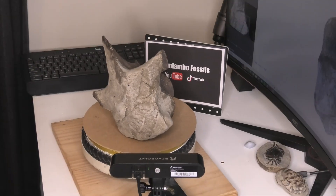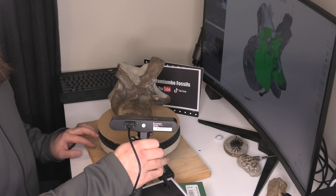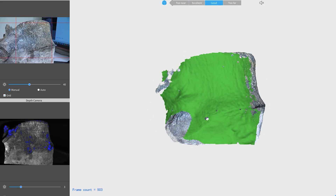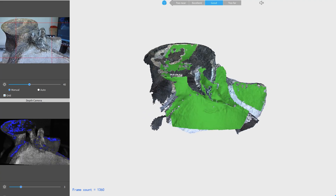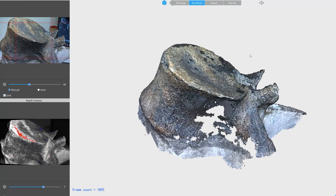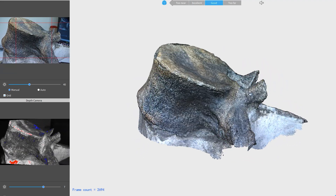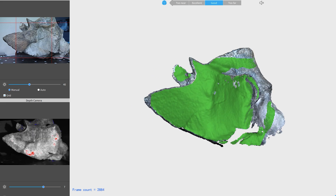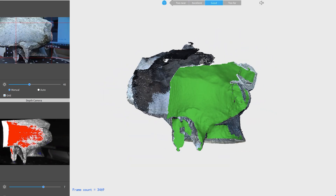What's nice with the 3D scanner is you can keep it on the tripod, but you can also pick it up and try to get into the areas that are more difficult to reach just by lifting it. You can see on the screen that everything in green is being scanned. In the bottom left you can adjust the power of the laser or infrared scanning it — if you're seeing a lot of blue, turn it up; if you're seeing red, turn it down. What I found worked well is to overexpose it, rotate it around, then pause it and underexpose it. That allows you to get a really good mix of getting into the dark nooks and crannies without overexposing the areas closer to the scanner.